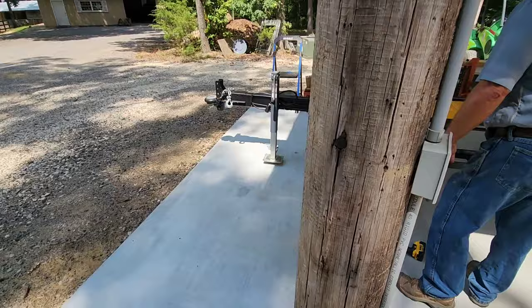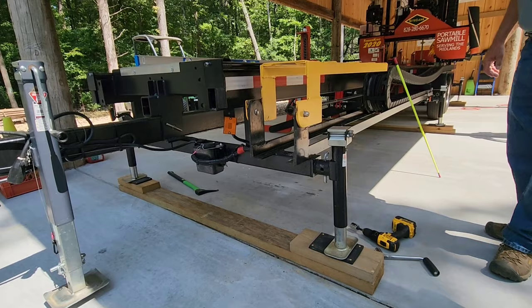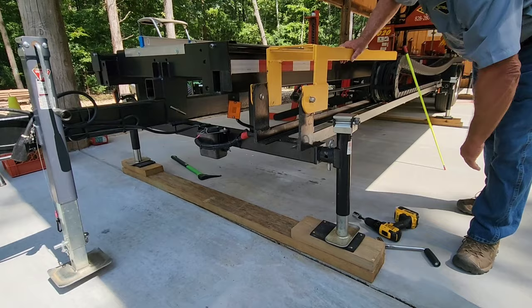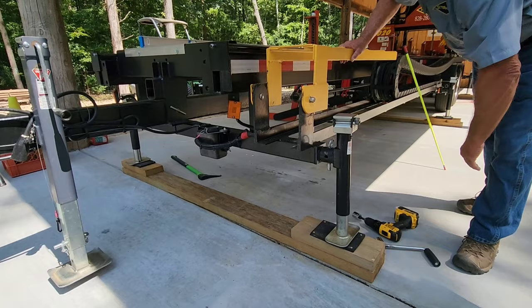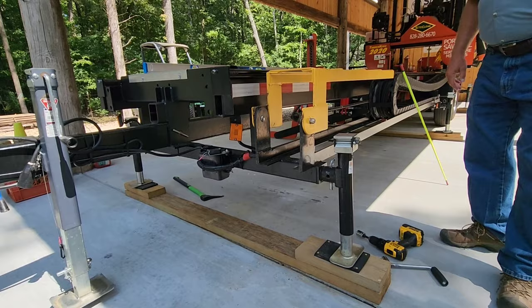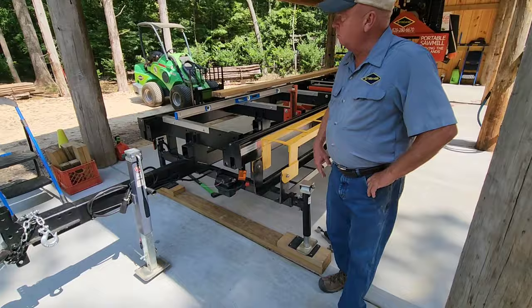One thing before we walk away — I want to show people this. Mr. Gary has done this correctly. Folks, if you're going to have your sawmill in a stationary location, you really need to have some kind of wood structure that goes across and everything. He's actually done even more — he added rubber stripping, like conveyor belt material, screwed down so it doesn't walk around. That is critical because if you are putting metal legs onto concrete, the loading and unloading of logs can get your sawmill to move around a lot. On dirt, a sawmill leg can dig in and cause your alignment to be off. This right here ensures that your alignment stays true for a long period of time with use.